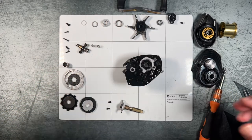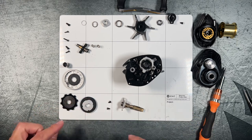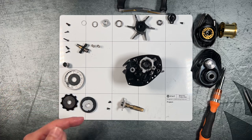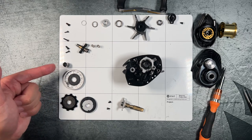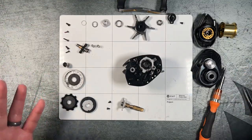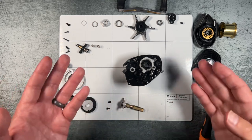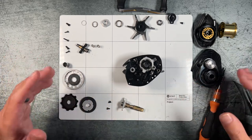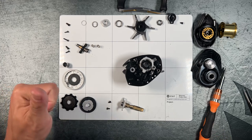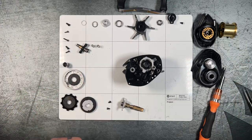At this point I'm going to stop the video because the reinstallation is essentially the reverse of the teardown: put back the main gear assembly and screw it in, install the anti-reverse portion and main gear drag clicker assembly — definitely put the sleeve on first — then put in your pinion, put the side plate back on, get your screws, and reassemble the handle side. The bearing upgrade to the worm gear bushing is worth it — it's made the reel feel even smoother than before, which is remarkable given how smooth the micro-module gears already make it. If you found this video useful, please give it a thumbs up, consider subscribing, and thanks so much for watching — catch you in the next one.